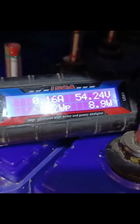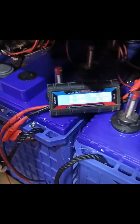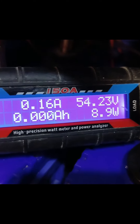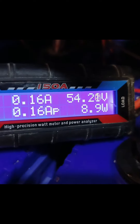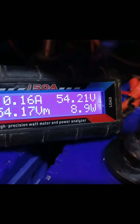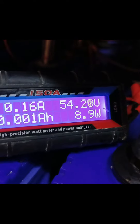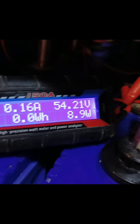All the voltages are harmonized — uniform, all producing the same thing. Let's go ahead and check the third unit of the battery, the third parallel, to see if it's still the same. The voltage is still giving us 54.2. We tested one, two, and the third parallel — all the same. That's why the battery equalizer is very important to have in a large battery bank.